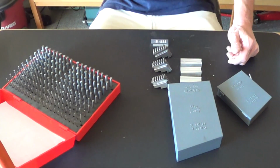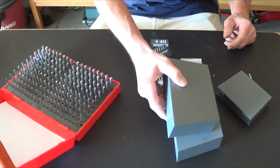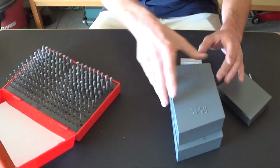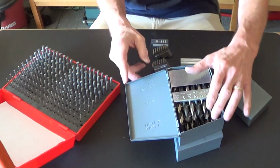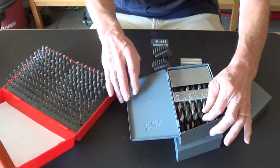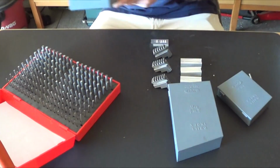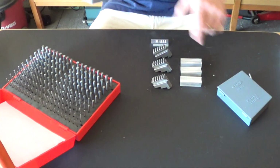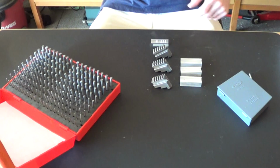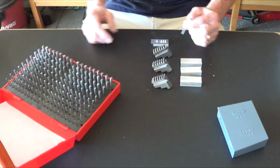And then, I don't know why, but there's an A to Z set. And they're all alphabetical. A to Z. T, U, V, W. It's crazy. So I've got all 3 sets, and it turns out there's no .120 in any of these sets except for the 1 to 60 set. So it tells me this was the drill bit that I used right here to make that hole.